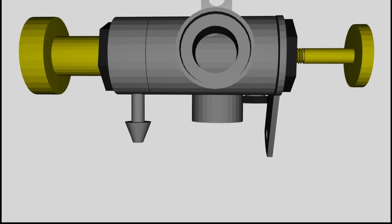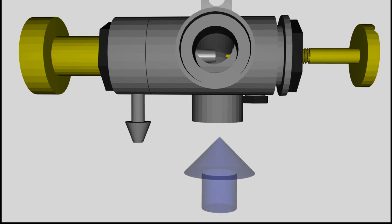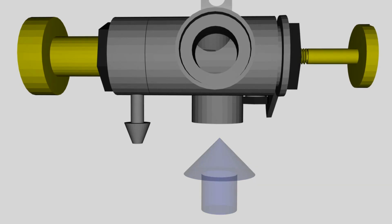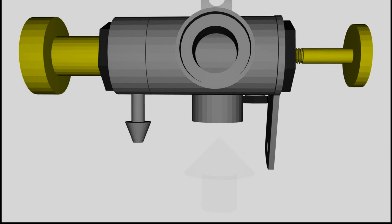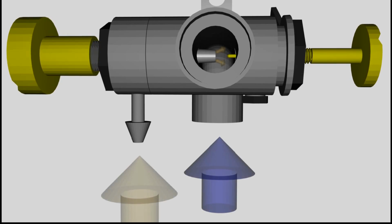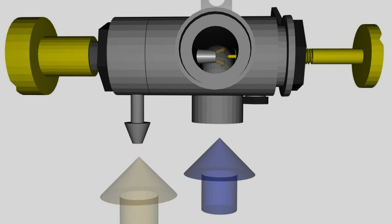The flow of air being pulled into the engine is metered by twisting the barrel with the help of the throttle lever. While set to full throttle, the maximum amount of air is entering the carburetor. While lowering the throttle, the transversal section is reduced and less air is passing the carburetor. If the pipe is shut completely, the motor stops running. Let's adjust the mixture screw to its optimal position, which is determined at full throttle on these small model motors.